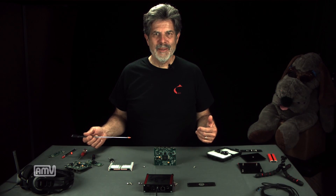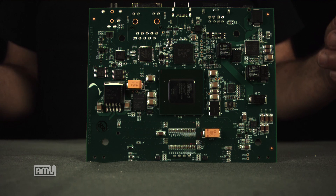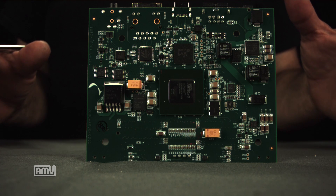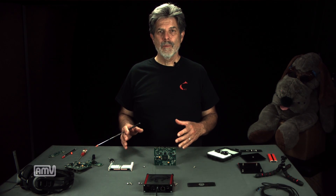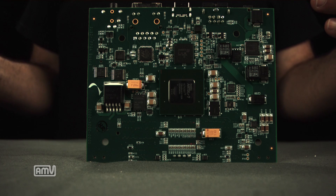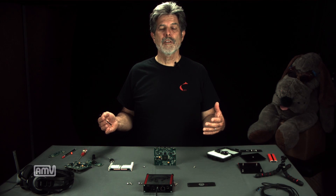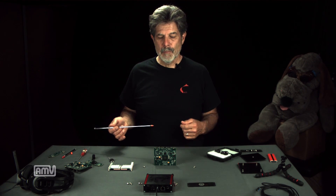Now we're looking at the top side of the FPGA board and at the heart of this is a Xilinx FPGA. We use this to control and process the onboard compression, our ISP functions, and if you want to add your own functions you can do that. You can also replace our code with your own. So if you want to write your own demosaicing algorithms, your own compression algorithms, or some kind of motion detection or object recognition functionality, you have the ability to program the FPGA and put your own programs on board.